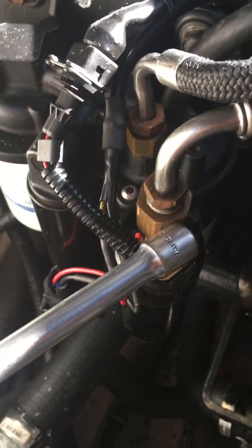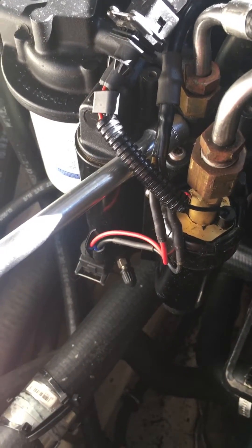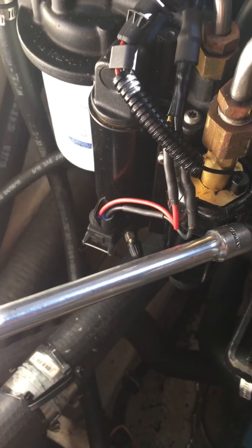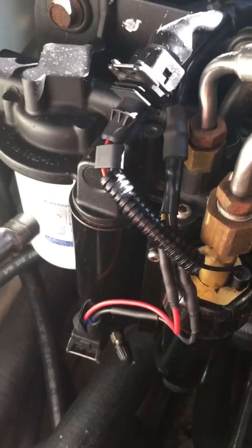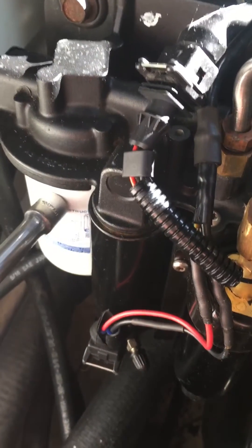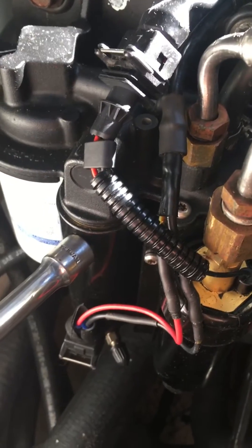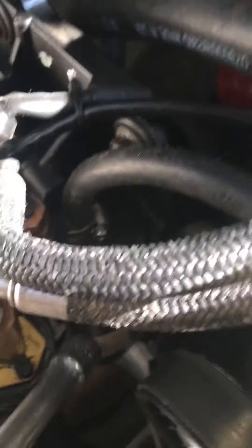unplug this high pressure fuel pump, let this one fill up the chamber and the fuel cooler, and then turn on and plug in this pump. Do a couple key cycles, but best bet is filling this up when it's completely dry with fuel — 93 — let this one prime up, fill this fuel cooler through this hose right here.